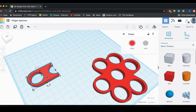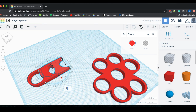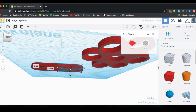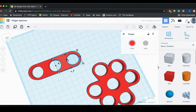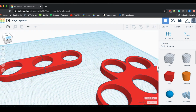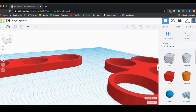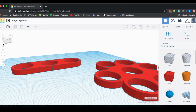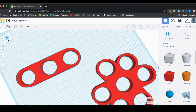So I'm going to duplicate, drag it out. I need to rotate it 180 degrees. And then put these perfectly back together. The trick here though is I don't want any overlap because that is going to change the size of that original bearing hole. And then my bearing wouldn't fit, but I also don't want a hole here. Otherwise, we're gonna have issues with the cracking. Okay, I can just barely see the line there.